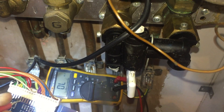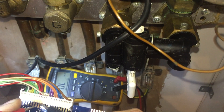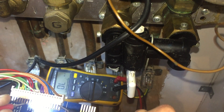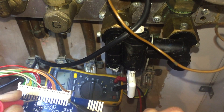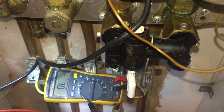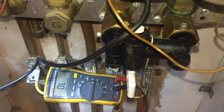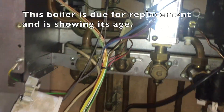You do that with each pin — move this down one, swipe it, move it down one, swipe it — and you're looking for the display to change. That's the easy way to find an issue on the low voltage harness. I visually checked it and couldn't find anything wrong.